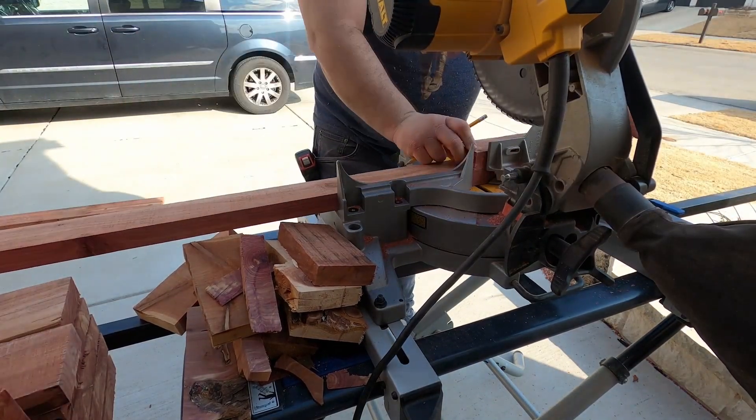I mill up all of the lumber and cut it to size using a table saw, a miter saw, and an electric hand planer. I'll leave a link below to the tools and products that I use in case you want to check them out. There are a number of different ways to build the planter boxes, but at a very basic level you need four sides and a way to join them together. You could use brackets or other things, but I think it's best to just butt one end up to another and screw them both into a corner piece like this.